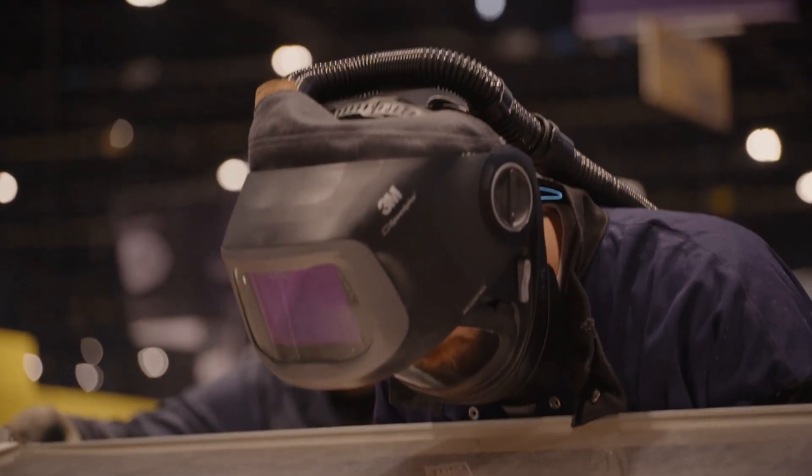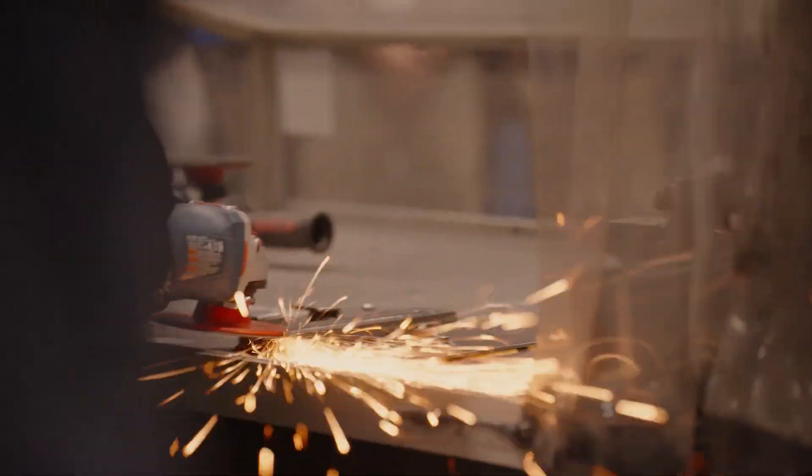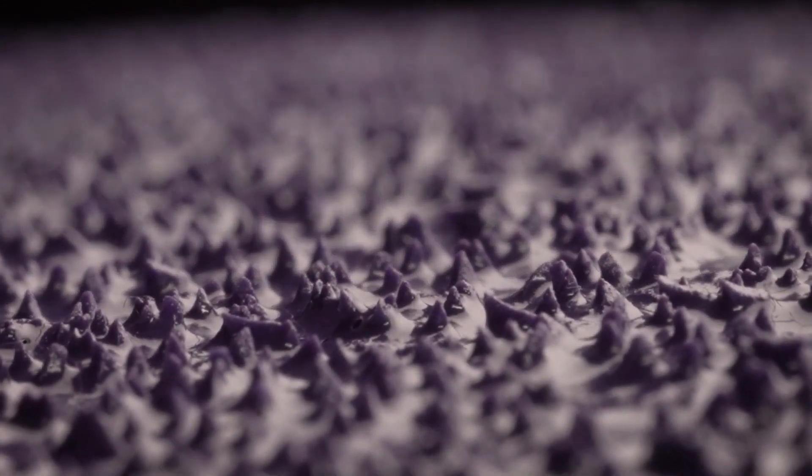Speaking about products, let's get back to the main reason why you're here with us today — the new 3M Cubitron 3 Fiber Disc. Why don't you tell us a little bit about it? Yeah, so this was the product that the students used in that last step trying to remove welds super fast. The 1182C Cubitron 3 Fiber Disc — which is our carbon steel product — is very fast. Compared to our old products, we have a new shape mineral that's sharper, cuts faster, and still lasts a really long time in the fiber disc world. And then we also have our stainless steel version — 1187C — for stainless steel or other substrates.